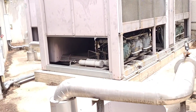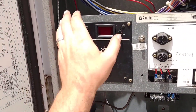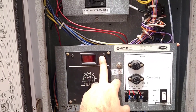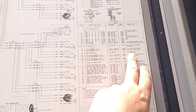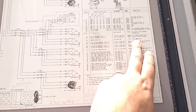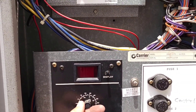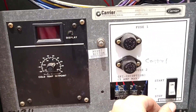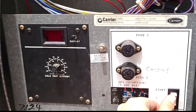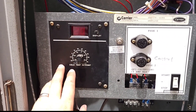Why is building B chiller not on? They're satisfied — they were on when I walked up, yeah, it's not calling. It's showing 65. We have a freeze protection low cooler flow alarm — that would be a pump issue, or the set point is too low. The set point is turned down — let's turn that back up. This is the set point control for the chiller itself; you adjust this dial, and these may not be quite perfect so you have to keep that in mind.